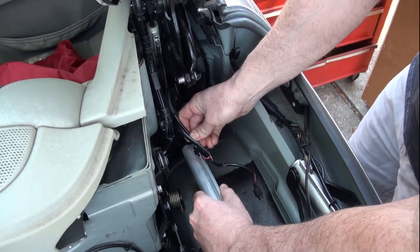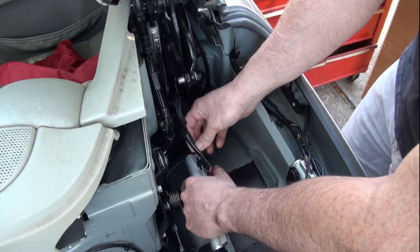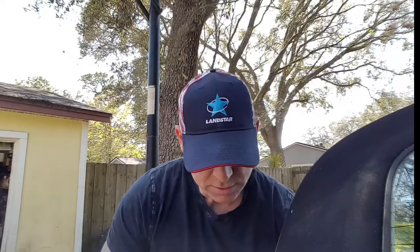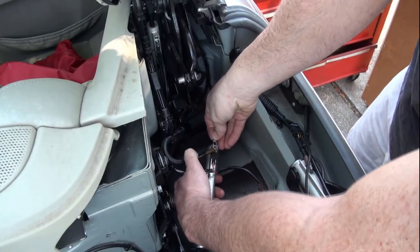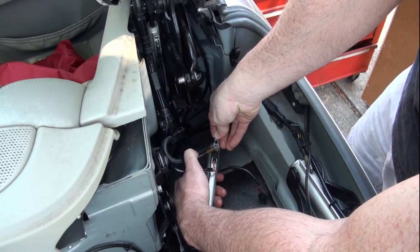It may take some coaxing to get in there — it's got a new O-ring there. You heard it click. These also have retainer clips. If you remember, these retainer clips held the hydraulic hoses in place, so we'll just slip those right back in place.